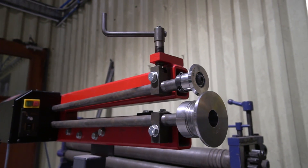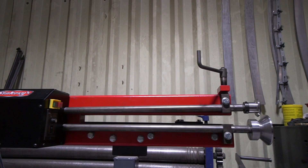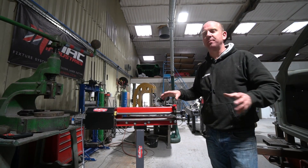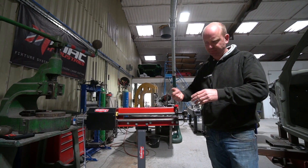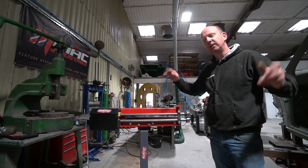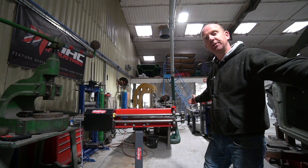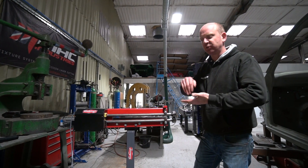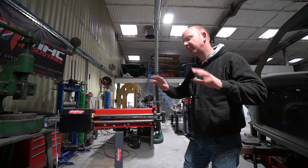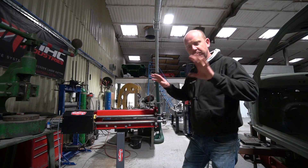What do we use it for? What other people might use it for and what we primarily use it for could be two slightly different things, because you have to bear in mind that we have this machine and we also have Henry Pell's nibbler — generally known in the metalwork world as a Pullmax type machine. It's a reciprocating machine, originally designed as a nibbler for cutting circles out of big pieces of metal before the days of lasers and CNC plasmas. It has approximately a yard throat on it and it's very easy to make dies for it.